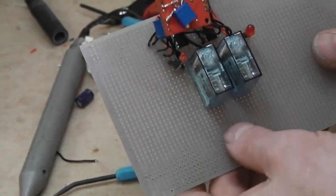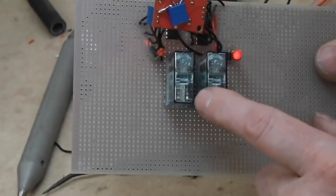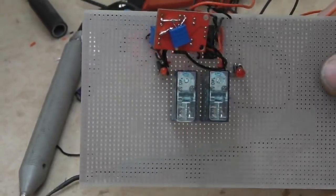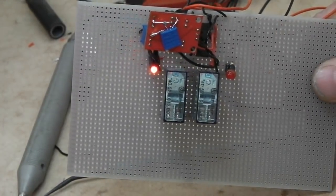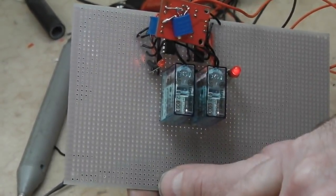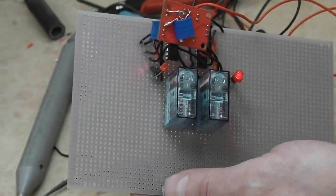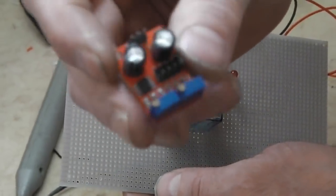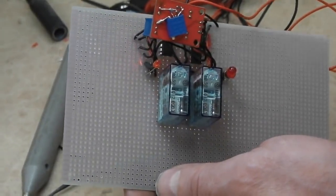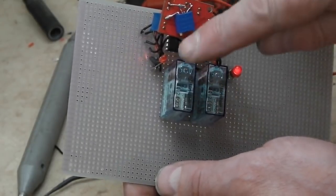I'll give it some thought about how I'm going to plan out the next box, the next module, and whether I can utilise any of this to share the system in those other two. The post wipe and the auto wash cycle. What's the auto wash cycle? Can we use the post wipe system here somehow? I don't think we can. We just need to rebuild this again for the post wipe, because the post wipe really only needs one little timer, which they're already built. So really the post wipe's dead easy. It was this cycling system that we needed to sort out. Post wipe definitely doesn't need any decade count. It's just because this needed to be programmable.